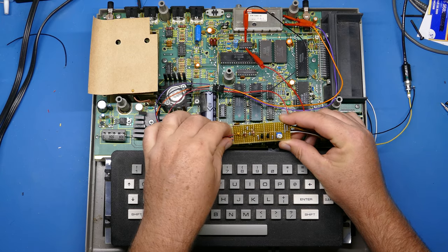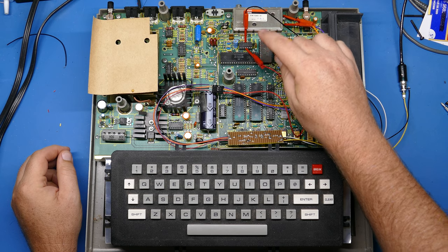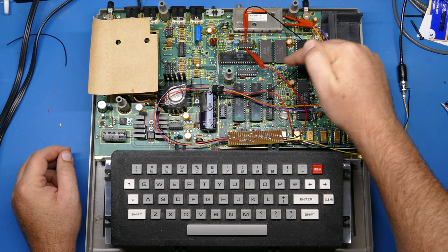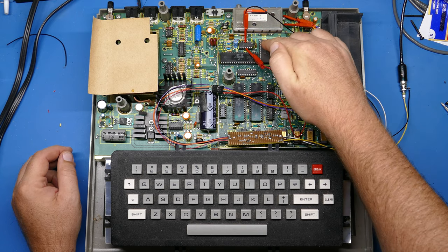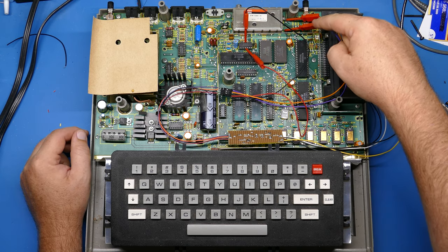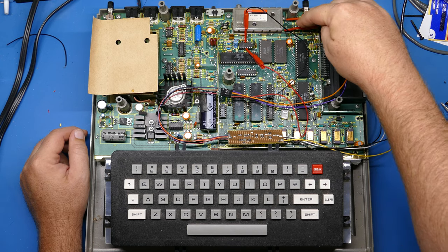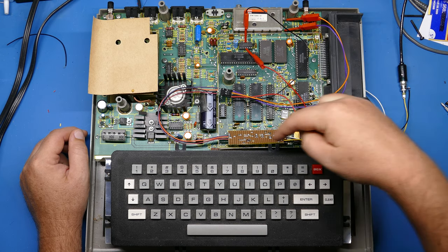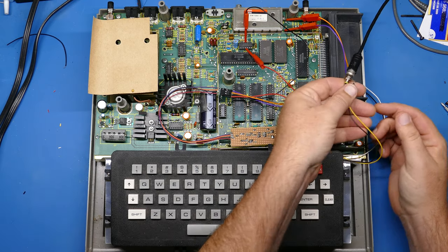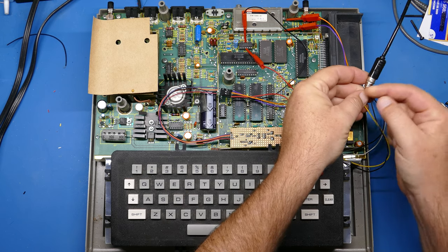And what I've done here is I've connected it to 5 volts and ground, and I'm just pulling that off of this chip here because I know where that is. When I actually go to connect this to the board, I'll probably find some other ground and plus five volt points to connect it to. Over here, I've connected it to the inputs, which are pin 1 from the RF modulator for the video and pin 3 for the audio. So those are coming into the board, and then they're going out after they pass through these components. They're going out into the RCA jack that I'll end up putting on the case if I want to keep this composite mod.